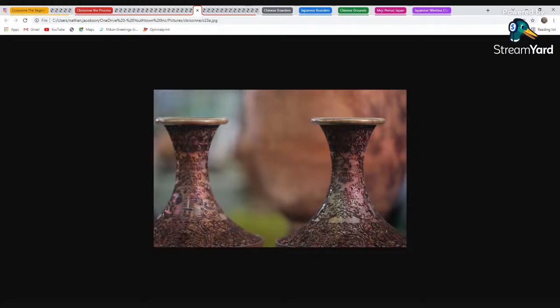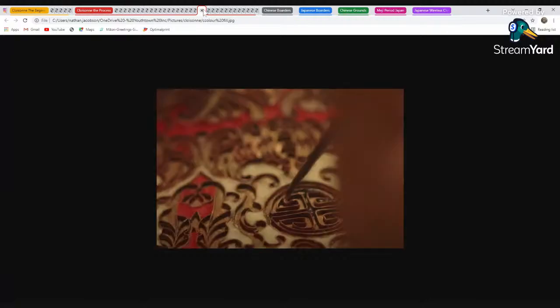And after that first firing, it goes on to the coloring. Now, the coloring, it's glass. It's ground glass that's put with a liquid, and it is gently piped onto the copper piece. The colorization, this particular step, is considered the most important step in the process of making the cloisonné pieces.